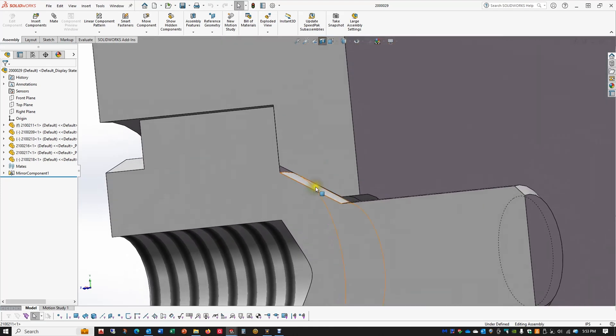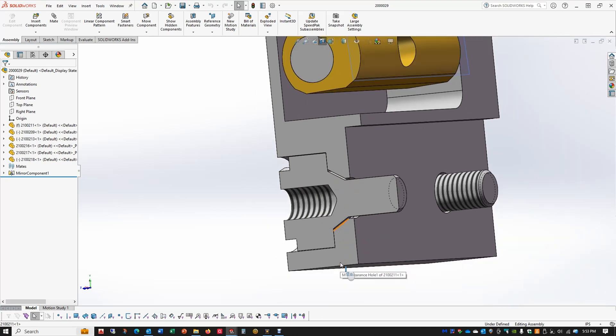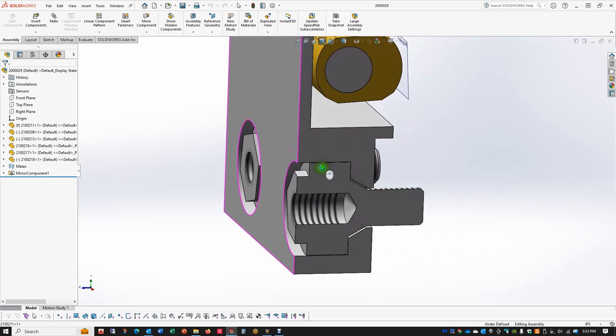In the design I've deliberately got clearance in the taper because I'm going to rely on this flat face to do the clamping. You don't have to — you could make it so the taper does the clamping — but this is just an easy way of doing it. Let's have a quick look at making these custom bolts and then we'll get into the assembly and testing of this device.